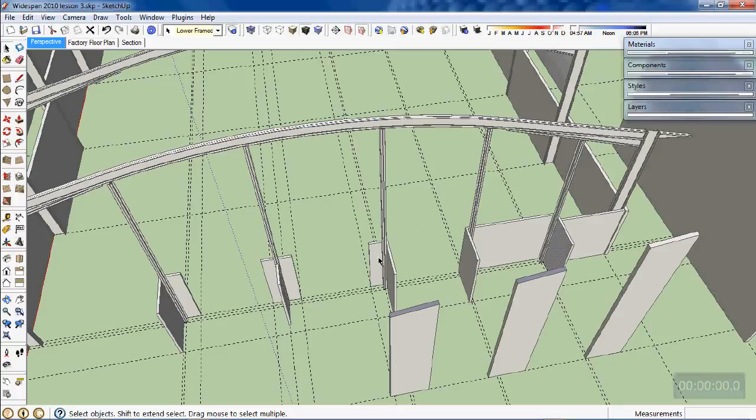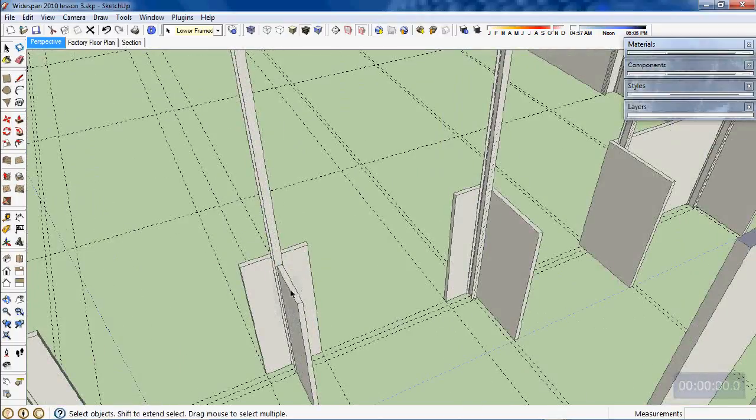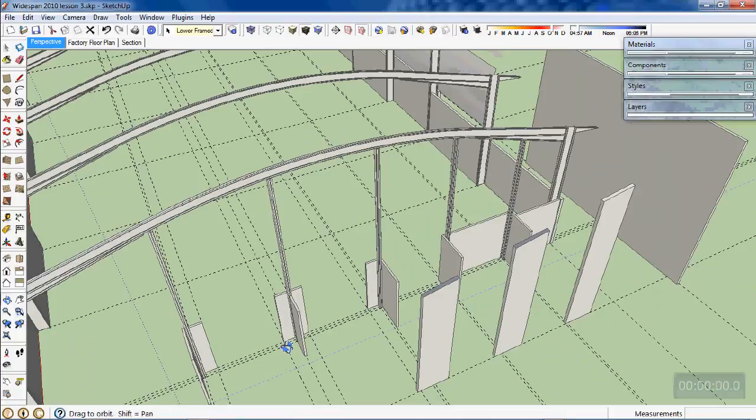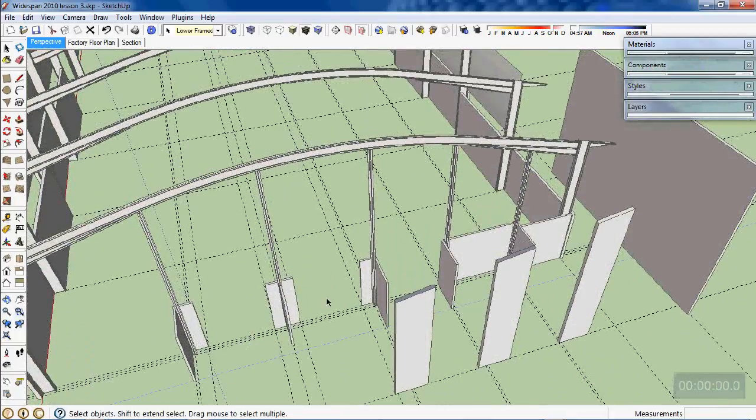These walls here, I've extended them to some set out lines which are set off 600mm off the column. So that's both that set out line there, this one here, and that one. They're 600mm off the column. And the front blade walls are push-pulled to a set-out line that is 1500mm off the centre line of the column. This one wall here goes into the face of the column. That'll be nicely in the centre of these two walls here. So you can pause the video at that point until you get all the walls up to that point there.